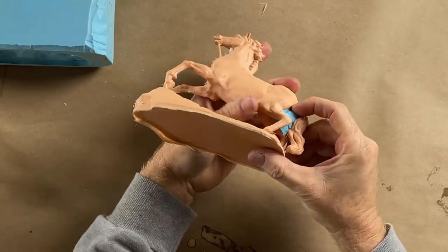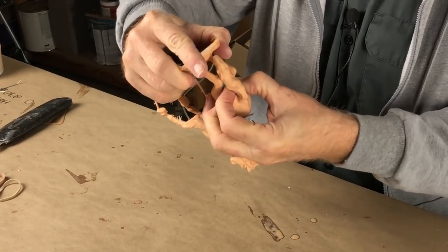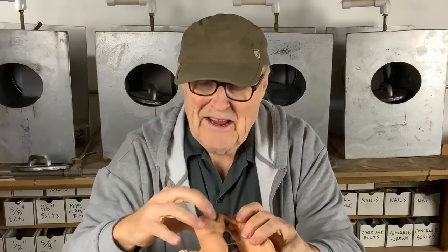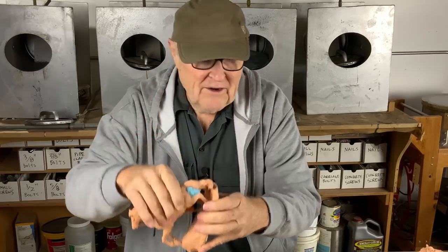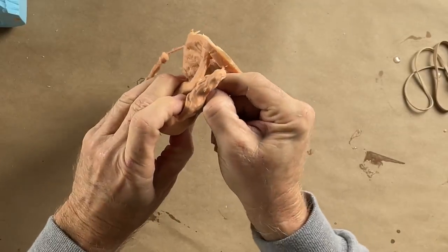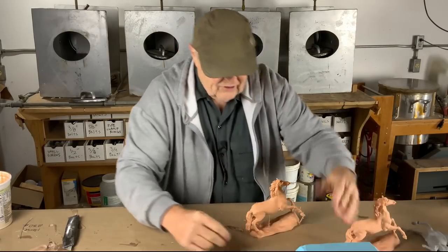Same deal as before — we have the little locked-in part but as you can see it's doing its job with no problems, casting that little inner part. Now some of you might think I'm contradicting myself since I tell you not to cut molds into pieces. But this doesn't have to be here — if I had cut it in the right place, this wouldn't be trapped. Instead I've got these difficulties with each casting — I have to coax this little part out of here. It's rubber, it comes out, no problem — one extra step, a little more time.